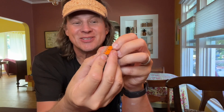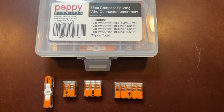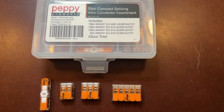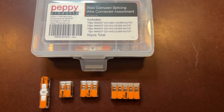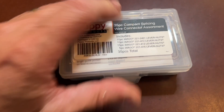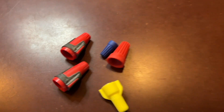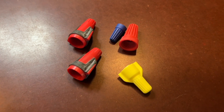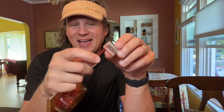To operate them is pretty simple. You just flip up whichever one you're going to put a wire in, then put the wire in from that side. This is a 20 gauge wire — it'll actually go thinner than this. Two wires, two wires, three wires, and five wires. You see it touch the back, then you just flip it down. You can see it's clamped in there pretty tight, which is amazing because it works with all the different sizes of wires. And you can actually see the wire in there — that's one of the beauties of these. You know if the wire is properly put in by looking inside, so no need to put black electrical tape over these.